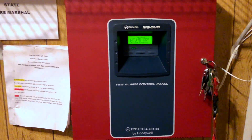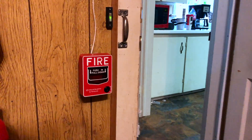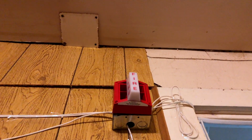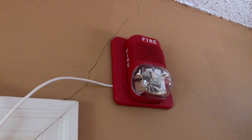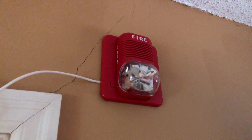Howdy folks, and welcome to walk test one, slash system test three. I went ahead and did some changes in the system. As far as the garage, the pull station and the horn strobe are the same — this BG-12L and my System Sensor NAS-S24. I did end up taking down the TrueAlert because I totally forgot that Simplex free-run devices are not supposed to run on full wave rectified power, so now we have a SpectraAlert running in strobe only right now.